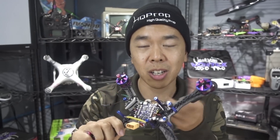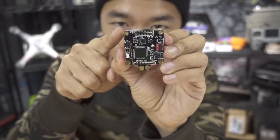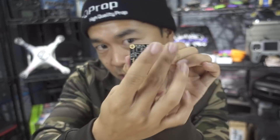If you have a flight controller like this and need to clock it to keep wiring clean — for example on a Remix frame where everything mounts underneath — you have to reroute the wires. When you flip the FC, what was motor one is now three, and so on. It gets really confusing. I'm going to show you a way to do this without losing your head.